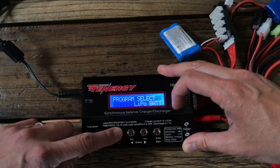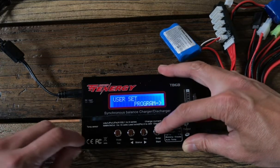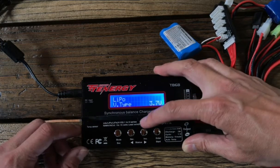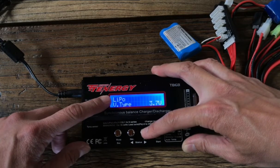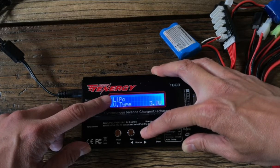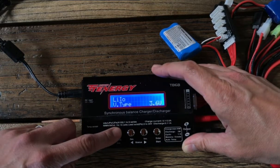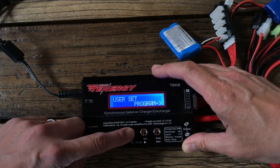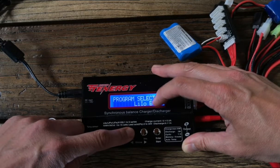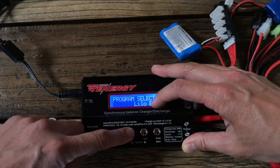How we do that is we go back into the menu into Programs. Once you see Programs, click Select and then click that again. When you see it flash, toggle and you're going to see LiPo turn into lithium ion. There are actually three choices: LiFe, lithium polymer, and lithium ion. Once you get what you want, click Enter and go back to the menu. Where we saw lithium polymer we're now going to see lithium ion — lithium polymer no longer exists in this menu, replaced by lithium ion.